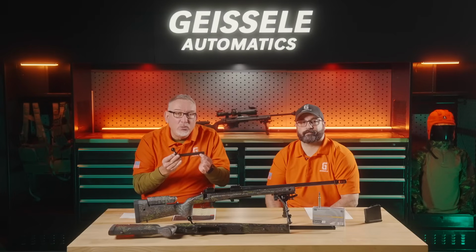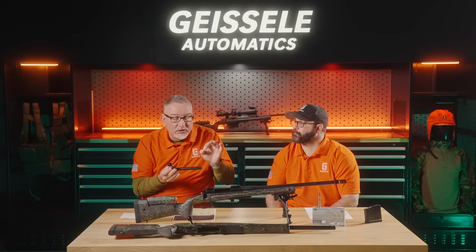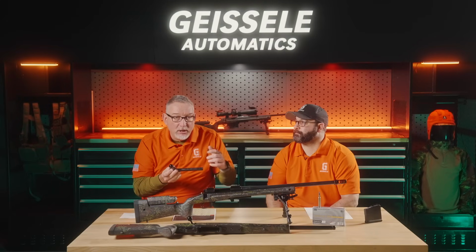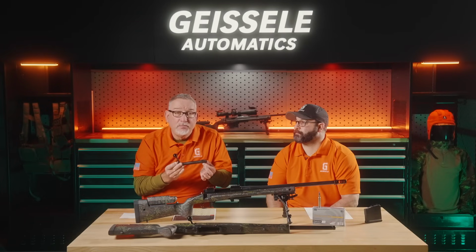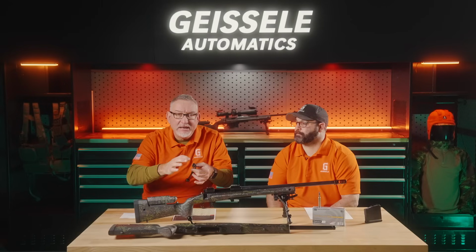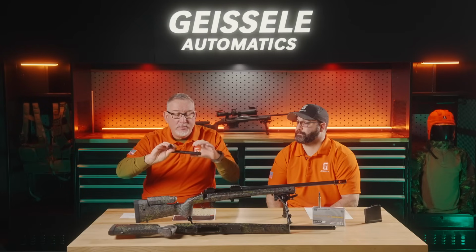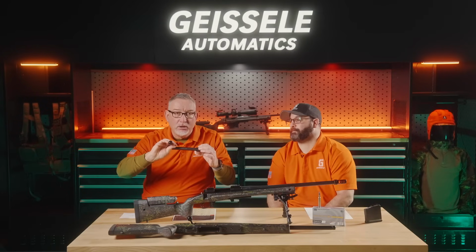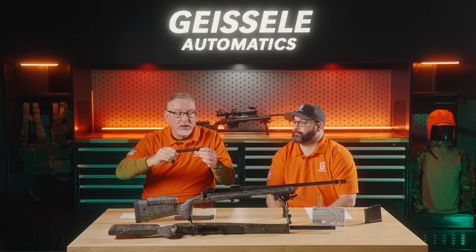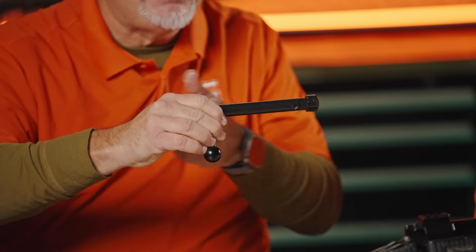I can't really tell. Why did we do it? We call this action a high pressure model. Even though, as we found out, the federal cartridge did not necessarily need some of the things we did for it, this baffle we now call a shutter. And that means that there is no pathway from here to the back of the action. So when you're locked up, there is almost a 100% seal going back toward the shooter with this shutter right there. If our shutter wasn't here, and anything happened out here, there'd be a clear pathway for the gases to get back to the shooter, all right?